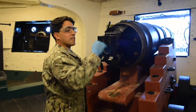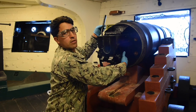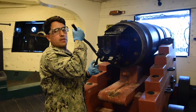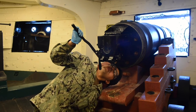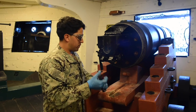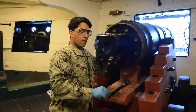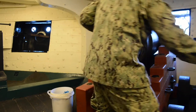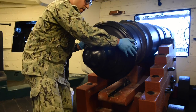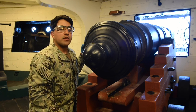One more time, because that's what the MRC says to do. Push your charging handle forward, look down the barrel, ensure it's safe, pull back on the charging handle, pull back on the extractor lever, ensure it stops on our safety lever stop, pull back on that, pull down towards us — check for the third time. Firing pin is present. Pull back on that safety lever stop and dismount our charging handle. Pull our top cover down and do the last step: put our back cover on. That's our stowed position, and that concludes our reassemble and function check of the Mark 11 Mod 2 40mm battery.